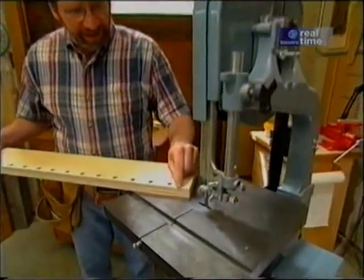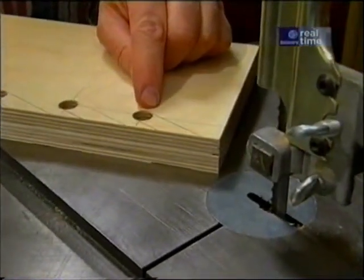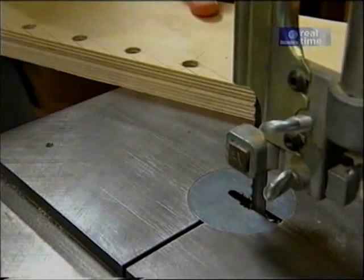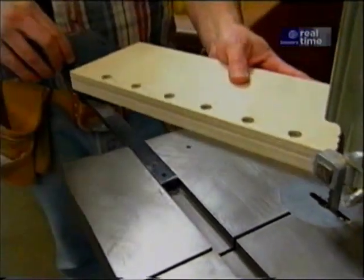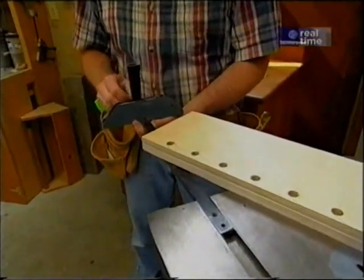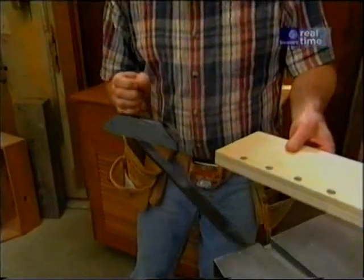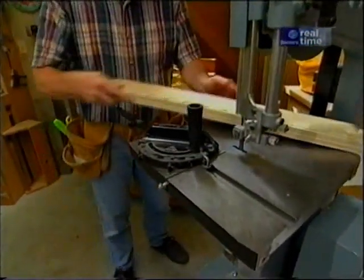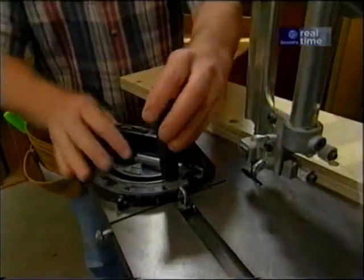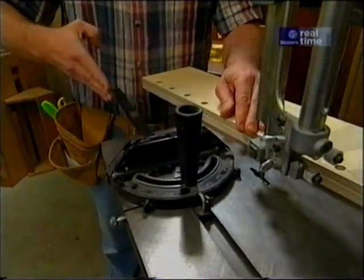The best tool to cut out this material to the hole is the band saw — if I use the circular saw it would over-cut. I don't want to do this freehand; I want very accurate cuts. Now if I try to use my miter gauge to angle it, it doesn't go far enough back and I can only turn it to 30 degrees, and that's not enough because I need 25. Now if I was to take the miter gauge and turn it around I get a little bit closer to the blade but I'm still limited by 30 degrees. So what I'm going to do is go back to 90 and make a little jig that'll give me a 25-degree angle.